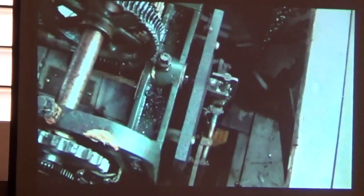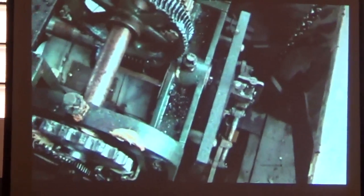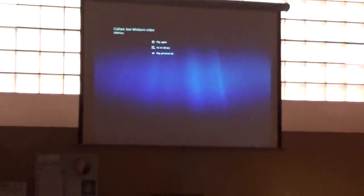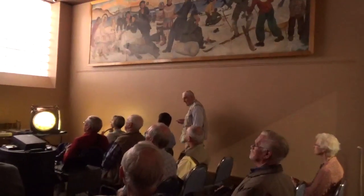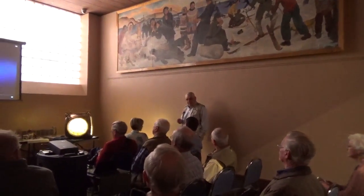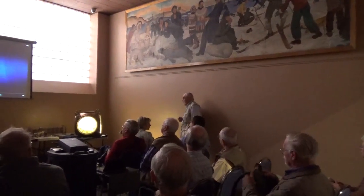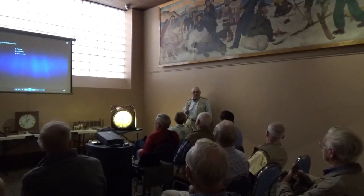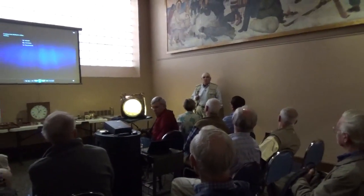Well, that's one of the secrets. One of the reasons these winding systems didn't survive was they didn't grease them. If you don't grease those things probably about every 2 months, it'll eat itself up. And you know about the Seth Thomas records, that Seth Thomas, on number 16, the Joseph Mayer, put an auto winding system on it. I would dearly love to know if any Seth Thomas tower clock or street clock ever showed up with that system. But yes, Seth Thomas was evaluating this, sent Mayer a tower clock mechanism, and Mayer fitted it with the winding system and sent it back to Seth Thomas. But that's the last we heard.